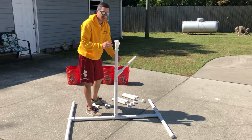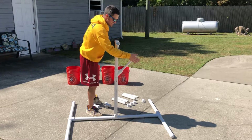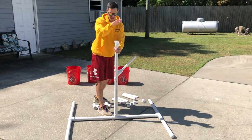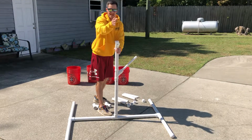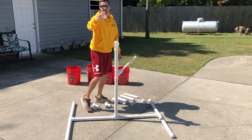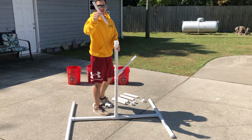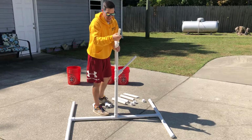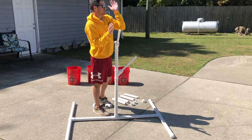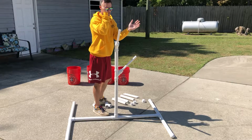Except every time we build up, we're going to rotate the 45-degree 90 degrees. So now instead of that elbow being in line with this base leg, we're rotating it 90 degrees. So now it's pointing toward the camera. We're going to do the same thing. We're going to take our 1.5 inch filler that converts it to a 3/4 inch, pop that in, take our 1 foot, 3/4 inch pipe, and pop that in. So now we've got, just to say, one facing east, one facing south.